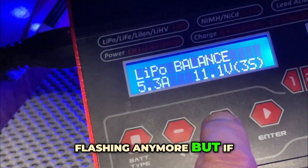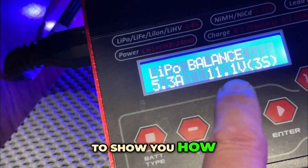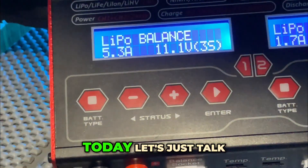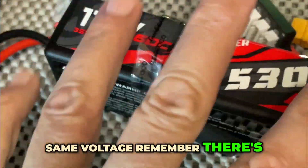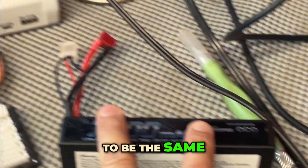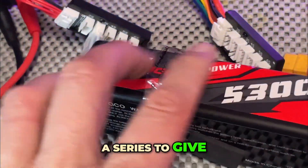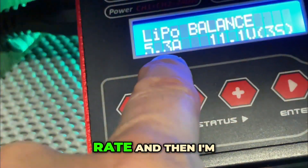Today I'm only going to show balance charging. Most of the time people discharge the battery all the way down, and if they don't, that's another story — there's also lipo storage mode. But for now, if you're charging a battery and you want all the cells to have the same voltage — there are three cells in this one and three in that one, two in another — this balance lead helps equalize them. Here I'm telling the machine to balance these three cells wired in series to give me 11 volts at 5.3 amp hours, and I'm going to refill it at that rate.